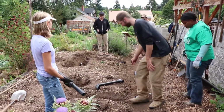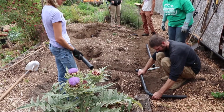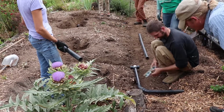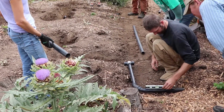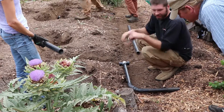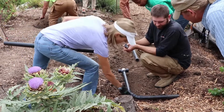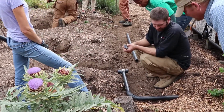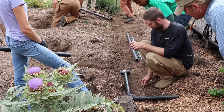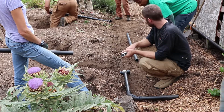So, glue this all together. Give us an idea of how it's going to look. So what kind of elbow do you have there? Two short ones? That's actually two 45s to make a long turn 90, with a piece in the middle. A piece in between. Right. We don't have long sweep 90s. But the two of those together make the long sweep. Have we done it any longer?